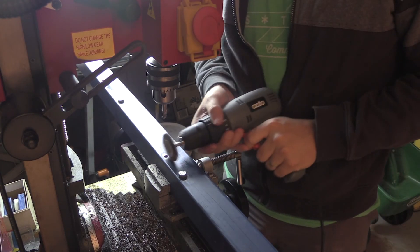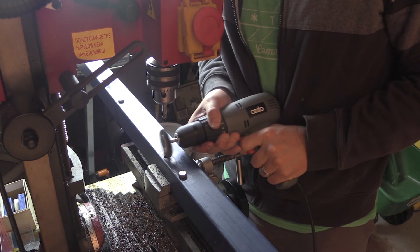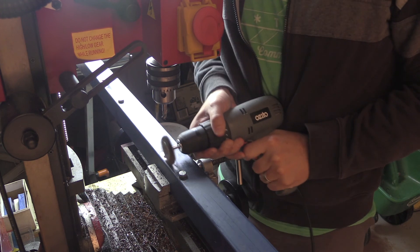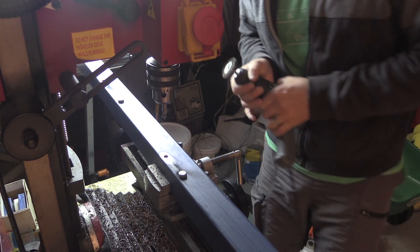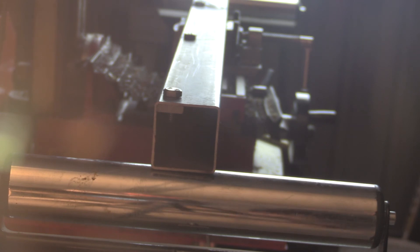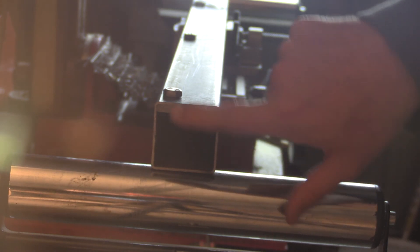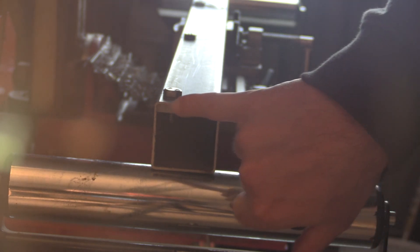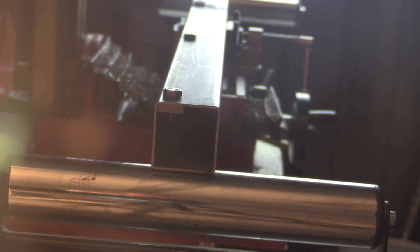With all that done, I've drilled a couple of plug holes here. These plug holes are going to be used to tack that piece of bar in place, especially in the middle so it doesn't sag. I've managed to get the bolts in there. Here's the side view — all I've got to do is tack weld the side of that, grind it nice and flush, weld those plug holes, and we should be pretty much sorted. Thanks for watching guys — in the next video we'll have a crack at getting this table assembled and welded up. Until next time, bye!